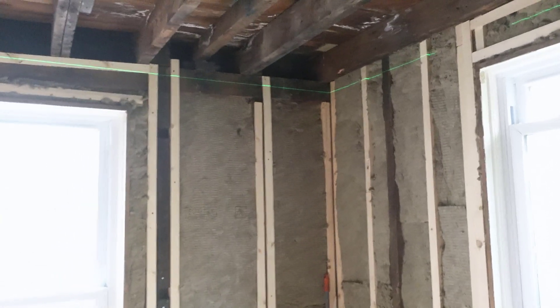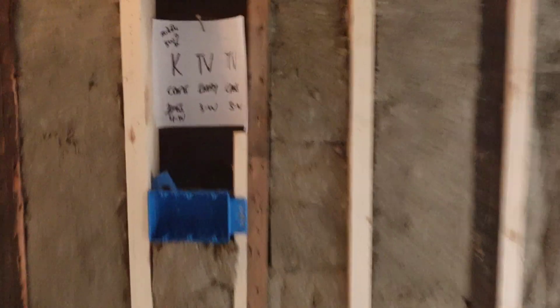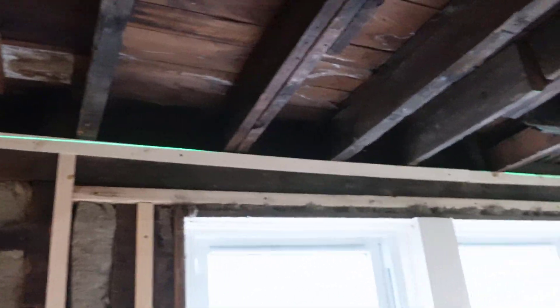Let me show you what we insulated. We were careful to get the cavities around the window as well. It certainly did change the acoustics — as everyone knows, once you put insulation in, the acoustics really change. We got that around there, certainly above the window. And over here all the way down — this is going to be a switch kit or switch package. I need access up there, that's why that's not done yet. I have ceiling work to do, so we didn't insulate any of the joist pockets yet. But when we're done, we'll get those insulated. Anything that's an outside wall — yeah, let's cut down on all this draft.